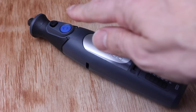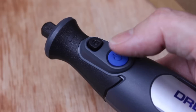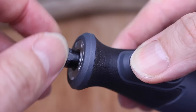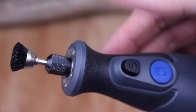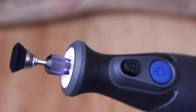Moving up the other end, you can see the nice rubberized grip for comfort and control, and two buttons on the end. The big blue power button turns the unit on and off. The smaller black button is the spindle lock. Hold and press the spindle lock button, unscrew the nut, insert your accessory — I've just got a little brush here — then tighten up. Finger tight will do, you don't need to over-tighten it. Release the button, make sure your accessory rotates, then switch on the unit.